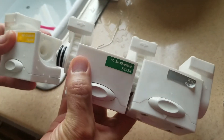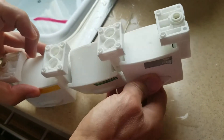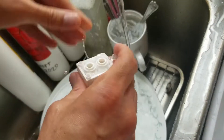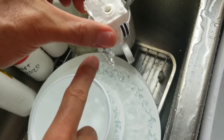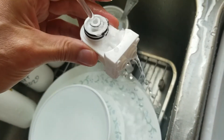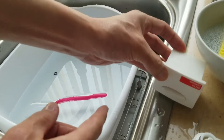I decided to make it a three-filter system, and these are the parts here. You basically take the parts apart — they're just screwed down by four screws on the top. This is the piece we're going to throw away; it's the part that works with the membrane filter. You can see how the water passes through on one side. The other two or three parts that look like this — water doesn't flow through the top — those are the ones we're going to keep. This one is the one we're going to throw away.